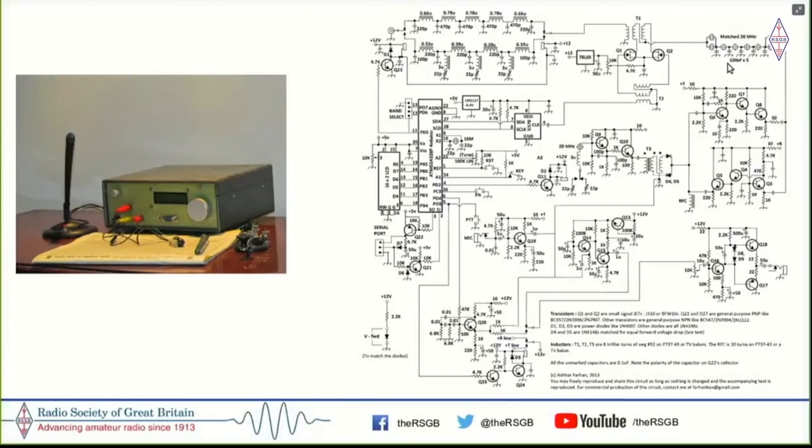Now, the thing was that this is at 20 megahertz and you are trying to receive signals between 0 and 30 megahertz, right? So there's a good possibility that something on 20 megahertz will also make it through this crystal filter. So what I had done was there's a switching between two filters. One was 0 to 14 megahertz and the other started from above 14, around 18 megahertz, and went to 30 megahertz with a trap for 20 megahertz. This didn't work too well here.